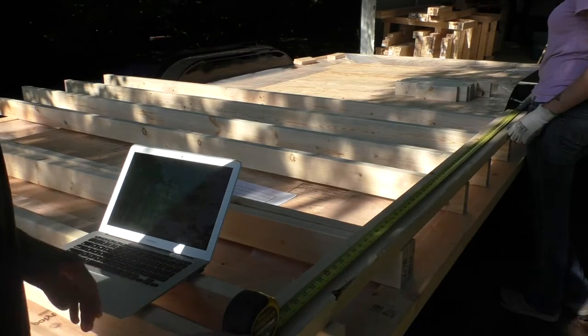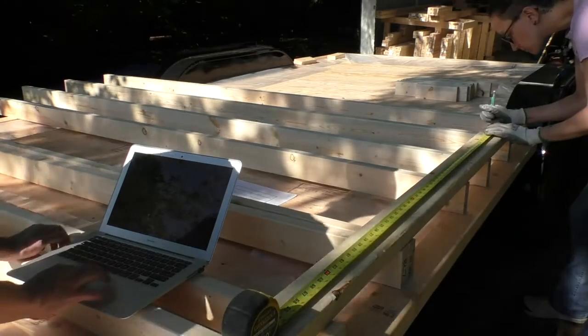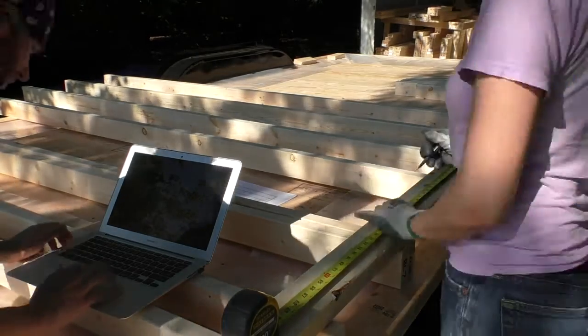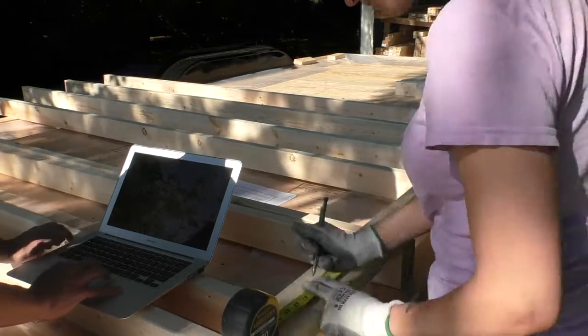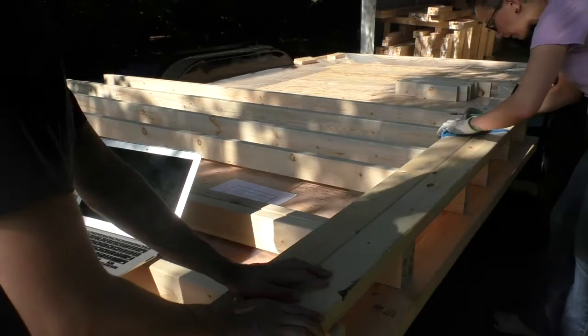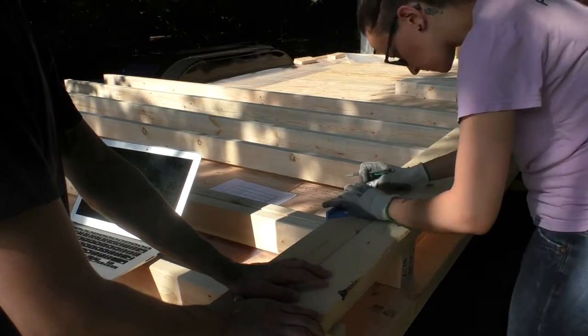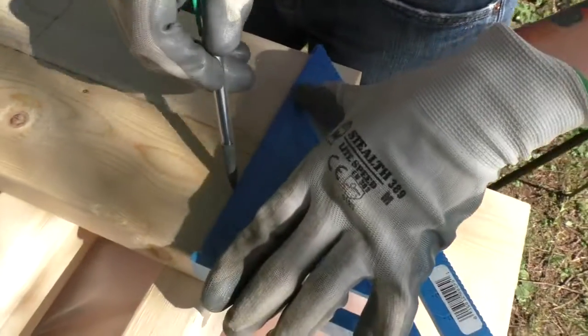With all the headers built and pieces cut, it was time to build a wall. We took the top and bottom boards and marked out where the studs needed to go. It's helpful to put an X on the side of your mark where the studs should attach so you don't get confused. For this, I simply used the SketchUp model and read out the measurements to Jackie. I could have used the printed designs and probably should have, just so I wouldn't have to use my laptop. We then used a speed square to draw straight lines on both of the boards at once.